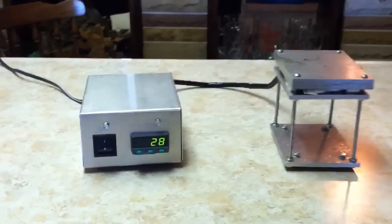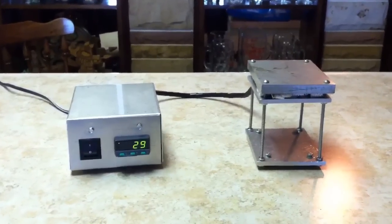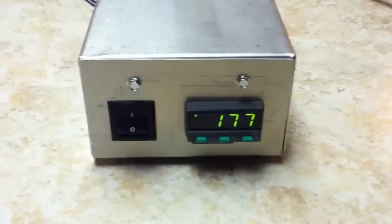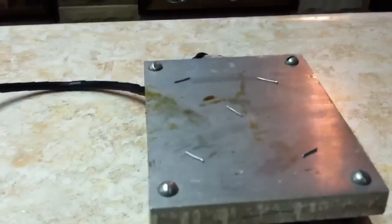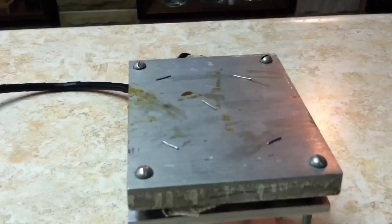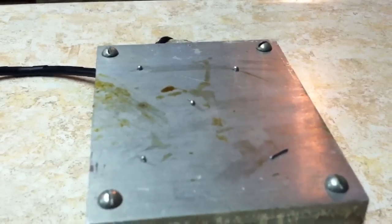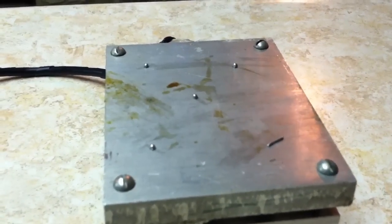It's at about 74 degrees right now, so I'll let it run and show you what it looks like when it finally gets to 190 and melts some solder. It's heating up alright. I found out the hard way that my solder definitely isn't 60-40 — it melts a little quicker at about 180 Celsius. It's 179 right now. You can see it beginning to melt, and the heat distribution looks pretty even; they all seem to be melting at about the same time. It's 181 right now.